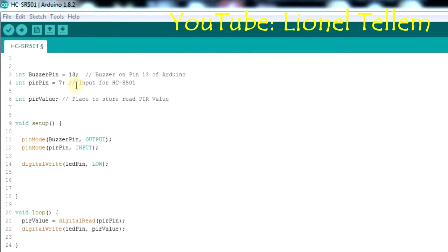Here I'll explain how the code works. We declare the buzzer pin and the PIR pin, and an integer variable called pirValue. We set the buzzer pin as output and the PIR pin as input, and set the buzzer to low. In the loop, pirValue reads from the PIR pin using digitalRead — it's either high or low, zero or one — and we write that value directly to the buzzer pin.